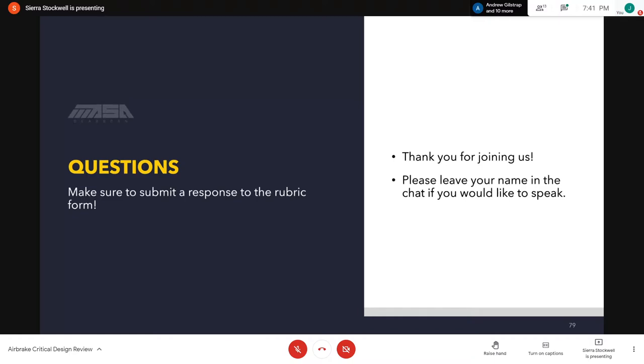No, it's a very good thing to note. Just as a note, a rocket's a very vibration-heavy environment. You're seeing a lot of vibration. Do you happen to know what frequency ranges you can see this mispositioning error? We could definitely filter it. I'm not quite sure, to be honest. Is it the update rate of the encoder itself that you're asking about? Well, I'm just wondering at what frequency of vibration you can start seeing that positioning error occur.